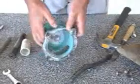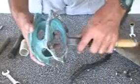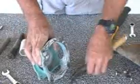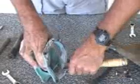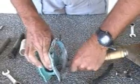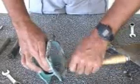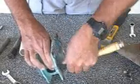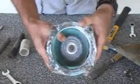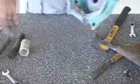Also, you want to be conscious on the back side. This one here, if you can see it, there's a buildup. This was on an aluminum end bell motor, and there's a buildup. There's a little groove here, a groove in the motor that meets this, and if I don't get this cleaned out, because this isn't the same bracket that I took off this motor, it's not going to seat properly. That's a lot cleaner. If you have to, you can also take a file across the back of this thing. That'll help tell you if it's flat, if you've got any buildup on it.